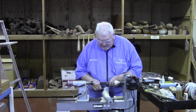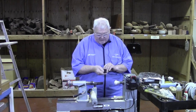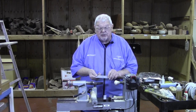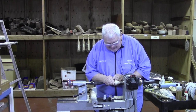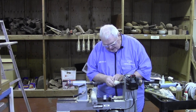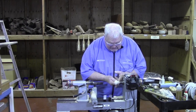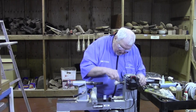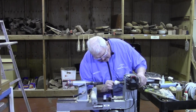We've not done any real heavy duty sanding — we did a little bit on the last project, and this one will be pretty much the same. So I've cut three pieces of sandpaper: a piece of 220, a piece of 180, and a piece of 120. The numbers appear on these but this one didn't show clearly, so I wrote on it so I don't get them confused. Now sanding here on the end is the hardest area — the reason is the wood isn't moving very much, so I have to keep my hand moving. As I come up around the curve I have a little bit of movement in the wood which helps. I'm going to examine it and sand with the direction of the grain a little bit, especially over this end grain area which is the hardest part to sand.